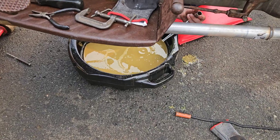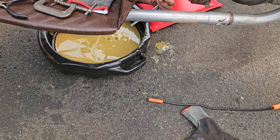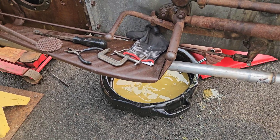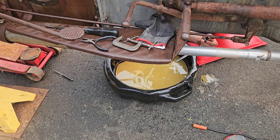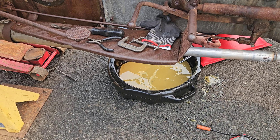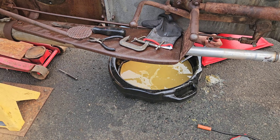There's the oil that came out of the transmission. Good thing we said let's check the oil in the transmission to see if we're okay. There are no globs coming out — no chunks or nothing. So whatever oil was trapped in the transmission, other than moisture contaminants, stayed okay. There are some metallic shavings in the bottom of the plug — well, it's a transmission, so some free anti-seize.